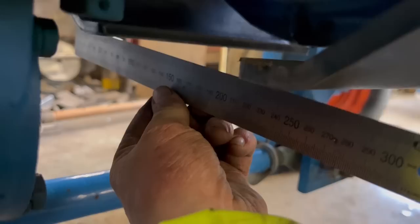Right, so I've got these side plates bolted on now, just with one bolt because I'm still short of bolts, but it fits nice and round. I've put another press, just a little one there, to bring this one up a little bit, and then I put another press at the bottom, same on both sides, so then I can put a plate across the bottom to box the bottom in, and then I'll plasma some side plates out to fill that big gap up there, I think.